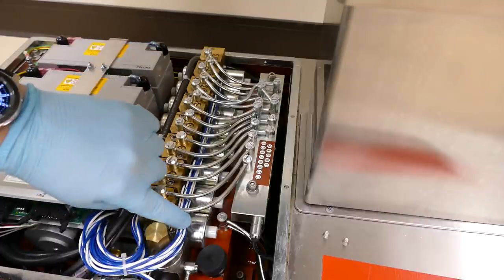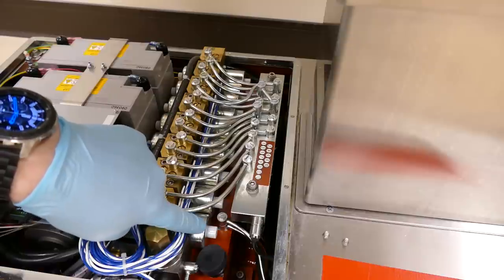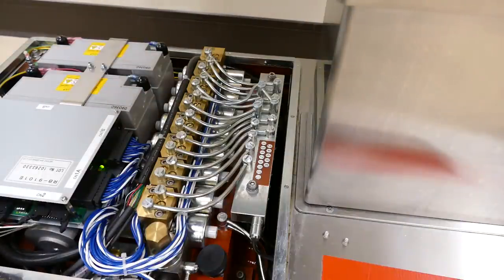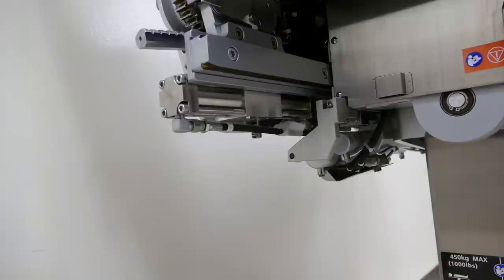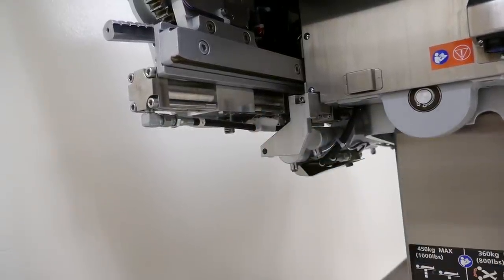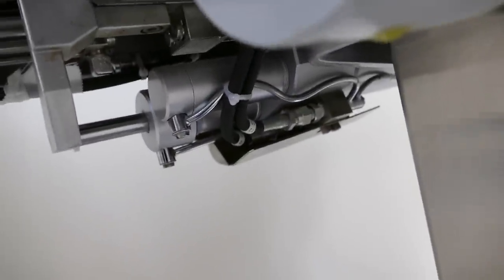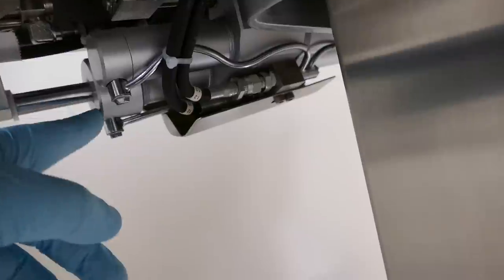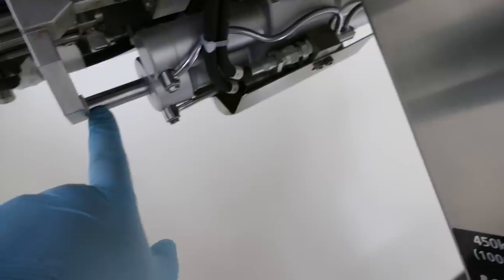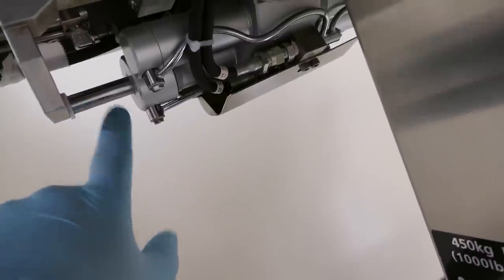To do the table slide — which is the problem — you'll notice it first locks the brakes. Now, one of the main reasons we have this failure is this hydraulic slide assembly right here. The staff has tape wrapped around the hydraulic cylinder — when they're positioning a patient or taping down drapes, they always tape around it. You can see the hydraulic shaft and cylinder — the shaft is exposed, and with no lubrication, they wrap tape right around it at the bump stop or at the wiper.